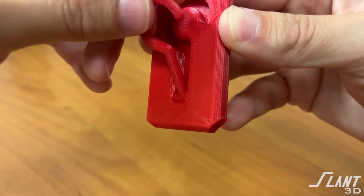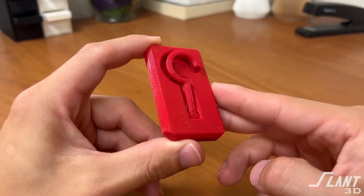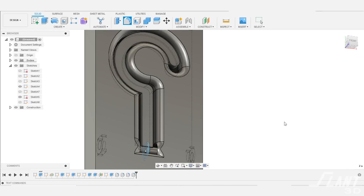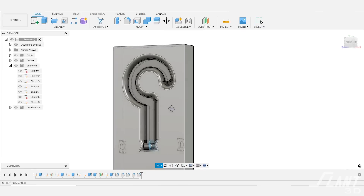Here's an example: a wall hook that is generally flat and flush inside its little slot, and you can flick out the hook itself to hang whatever you want. This isn't entirely new — you can see similar things in cars — but what's special is that this hook comes off the machine just like this: no assembly, no inserting the hook into an outer casing. It's just there. If we were to redo this one, we'd probably print it face down so the front surface is glass smooth, though that increases cost a bit. Printing it on its back makes it super strong, with a tough hook and a functional hinge. This combined mechanism — multiple parts printed in one go — cannot be made with any other process, and it creates whole new functionality that had never been possible before.